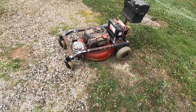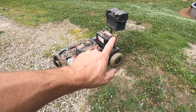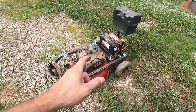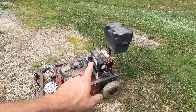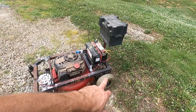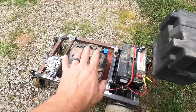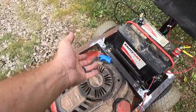It seems a little underpowered but I think it's just the 12 volts. I don't know if going to 24 volts just adds speed or if it also adds more torque, because there's no point spending the money on an extra battery if it only increases speed and not torque — it'll just make the wheels spin. The battery is only to run the motors; the engine is what mows the grass, so I still have to do the pull start.